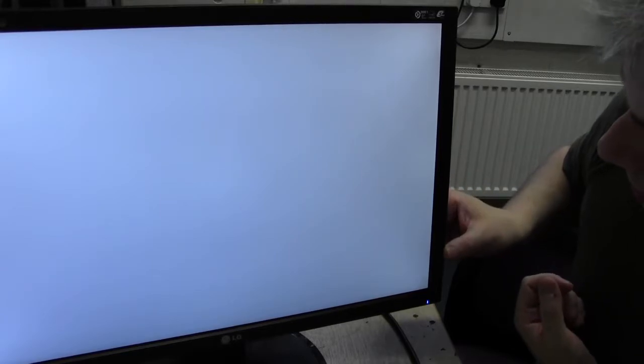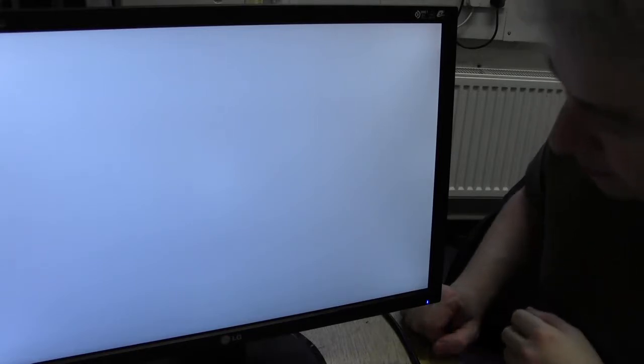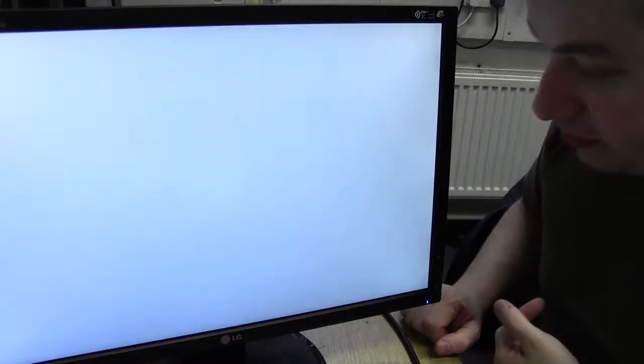So, no on-screen menus as such at the moment. White screen, flicking on and off, not a good sign. Definitely a power supply issue. What's probably happening is the switch mode supply is slowly getting its voltage levels settled. Trouble is they're not settled enough. Definitely probably a timing issue on the switch mode supply causing this. Okay, so it's not soft starting the microcontrollers well enough.